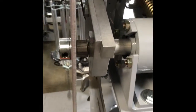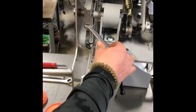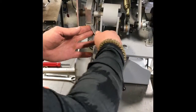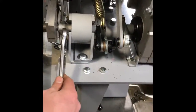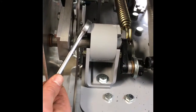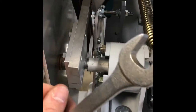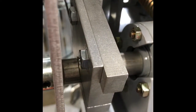When using dome targets — throwing RTC, teal, or Shondell — you want the pinch block to be all the way out. Using a three-quarter inch wrench placed between the pinch block and the clutch, push on it and you'll see it slides out to the outside. Once it stops, tighten it back down.